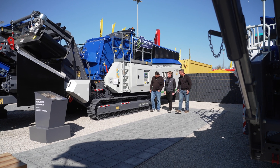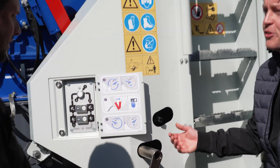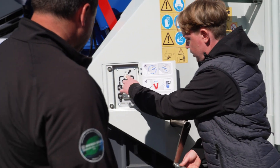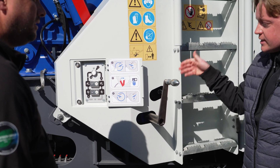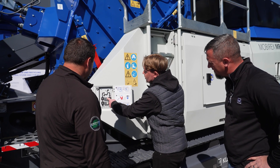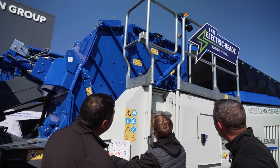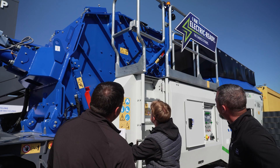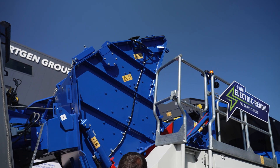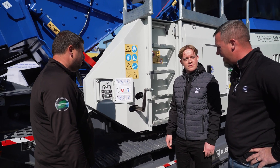Can we look inside the rotor housing? Yeah, for sure. Look at this. Is this how you get it started? No, it's for locking the rotor. The rotor has to be safe when we open the crusher. In the first step, we lock the rotor with the gearbox. Once it is locked, we only then can open the crusher due to safety reasons. After this, we pull the red locking wedges on both sides of the crusher - just by pressing the button. And afterwards, with another button, open the crusher completely. That means no manual work, no screwing any bolts. Just pressing two buttons. Wow, that's nice.